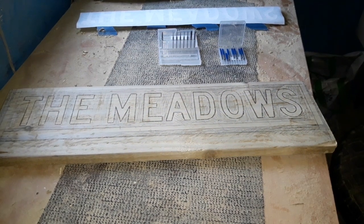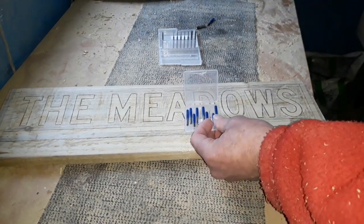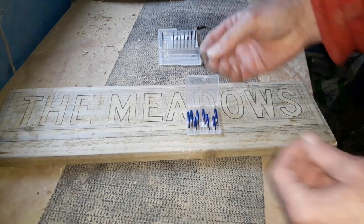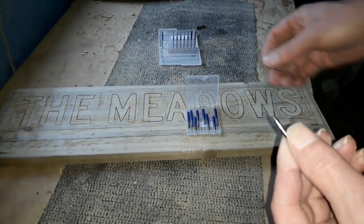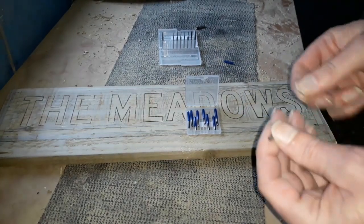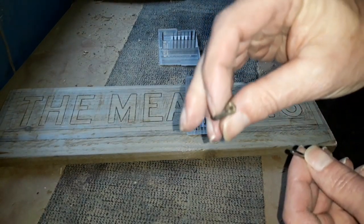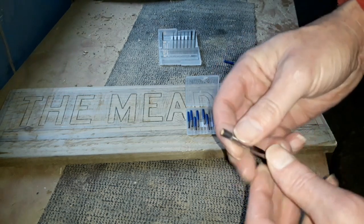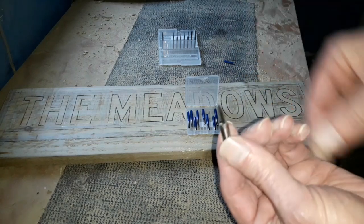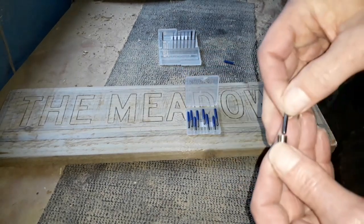The bits I like to use — and I've used them on all my projects — are the CNC bits. They come in a packet of ten. These ones are 30 degrees; they come with red caps, and they're like little needles. They have a Dremel-size shaft of 3.175mm, which is far too small for a quarter-inch shafted router, so you need a collet — a little sleeve that the router bit slots into — and then it fits your router no problem. If you're using a Dremel attachment, you won't need the collet.